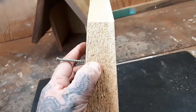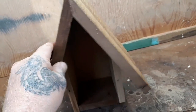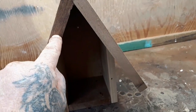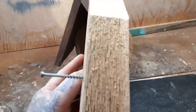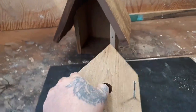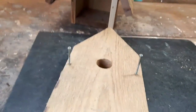This face is a lot thicker. This is 2 inches, but I normally just do my faces in like fence boards. This is cedar. Use whatever kind of wood you have in your area that's the best rot resistant. This is normally 1 inch fence boards, so that's what the rest of the birdhouse is made out of. Only the face I'm doing on this one, because I'm keeping it myself, is 2 inch, so I can make it thicker. The deeper you make your carvings, the better they're gonna look, okay?